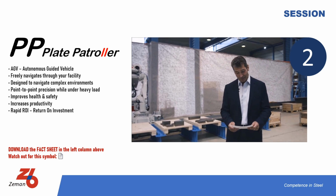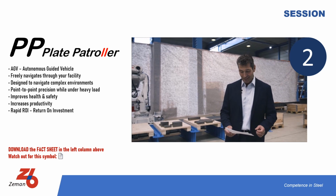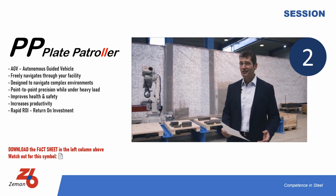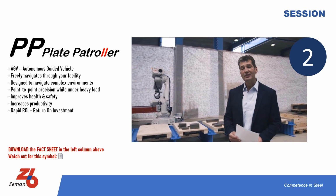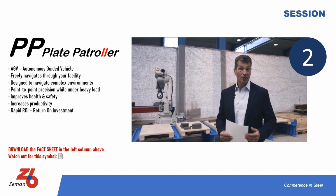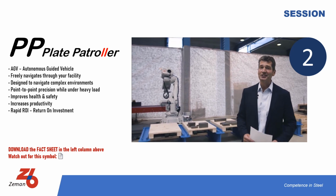Next and final question. How wide must the travel path be? That's Sandu from Romania. So in order to use the maximum speed, which I said already, 2 meters per second, there is a maximum space between of 1 meter. Everything less, the AGV, the plate patroller, will automatically reduce its speed. So these were the questions. Thank you very much again for your attention.